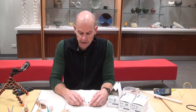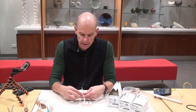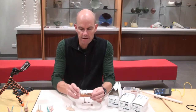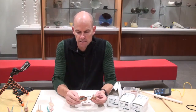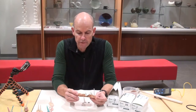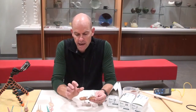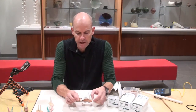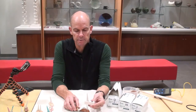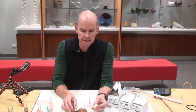When you are firing cones that only just melt and bend over a bit, they'll come out of the setter really easily. However, when you are firing something that's going to melt completely — say in this cone 10 firing, we've got a whole range of cones. We've got a cone here that was for a thousand degrees, and we're going to 1285 for cone 10. So that cone for a thousand degrees melts completely — it turns into a complete puddle. It sticks in there, or it goes all over your kiln shelf. So we don't tend to use these setters.